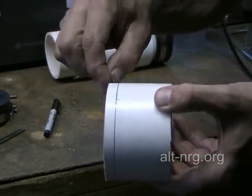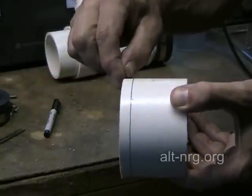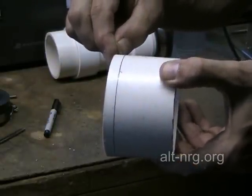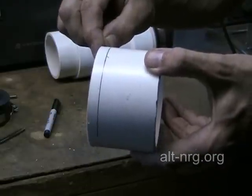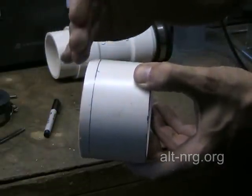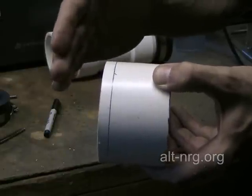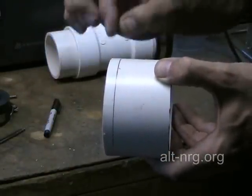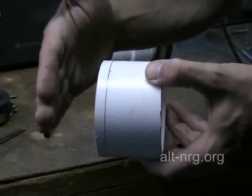There's my line that I'm going to cut for the shim. You might think that this is a very thick spacing between plates, and you're absolutely right — it is 5/16ths of an inch. It seems like a lot, but we need to maintain even spacing all the way down the stack. You're going to see in the end why we needed that extra gap when we get to the charged electrodes.